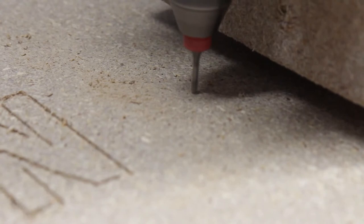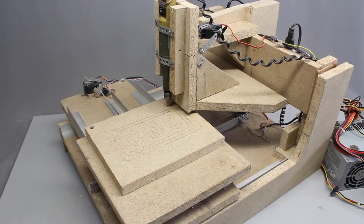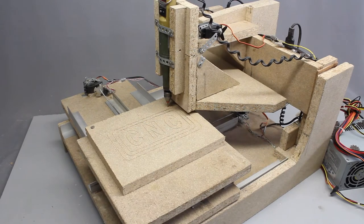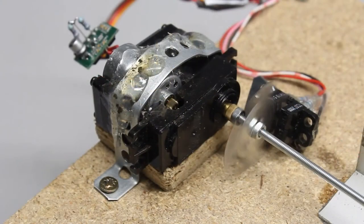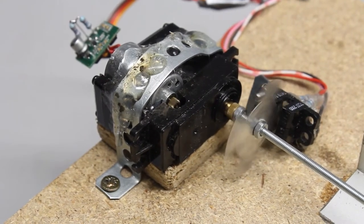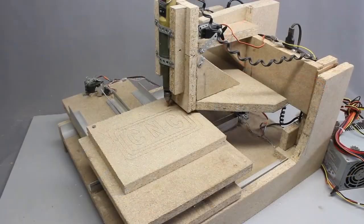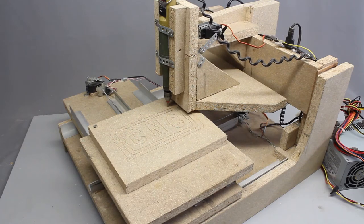This video is about a simple-to-build CNC machine. The machine has a work area of 20x20cm and a base area of approximately 50x60cm. It is controlled through an Arduino Uno and the axes are driven by 3 servos. The machine is composed of materials available in a do-it-yourself store, and you can build it on a weekend using only a few tools.